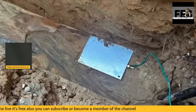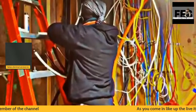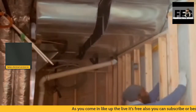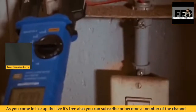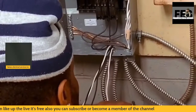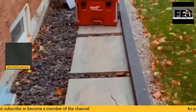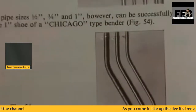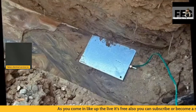You saw me using liquid tight conduit for a wet location, which is what we use here in Canada. We use liquid tight for those kinds of installations. You'll also see me using a different type of wiring for the AC units when I post another video. Again, there are many ways that you can do the installation. You just have to stay within the code compliance.